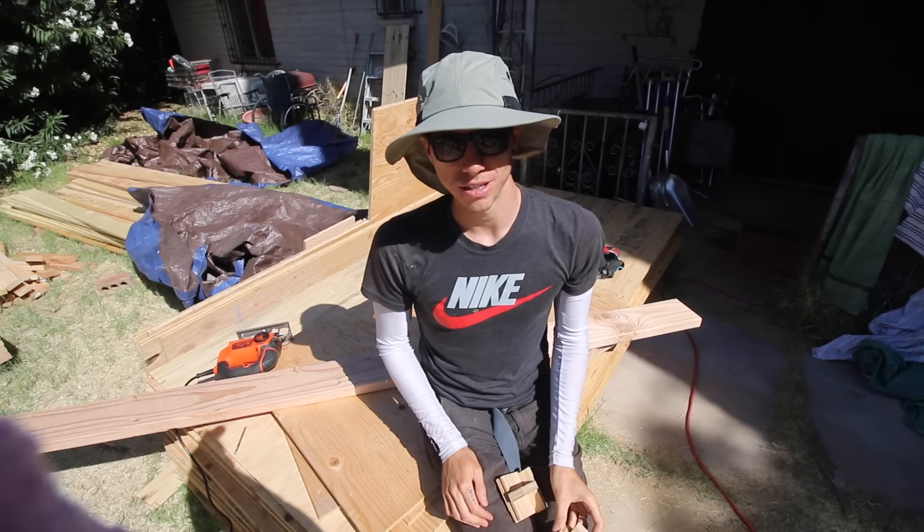What I'm going to do is get the joist up there with a couple of these hangers. Once it's in place, I'll get the hangers positioned, then put two screws — one on either side — attaching directly to the joist. The reason I'm doing that is so once the hangers are placed, I can bring the joist back down and hammer the joist nails in on the ground, then remove the screws and put the joist back up and hammer it into the top plate. When you're up there trying to hammer joist nails into the sides of the hanger, it's such an awkward position. It's much easier to nail on the ground where you get way better leverage.